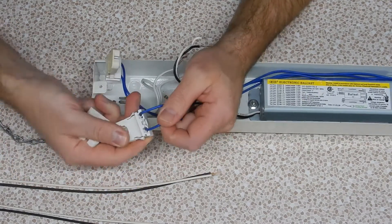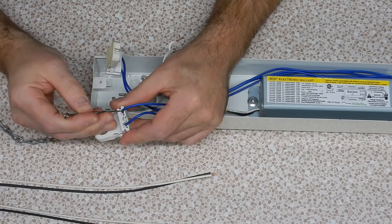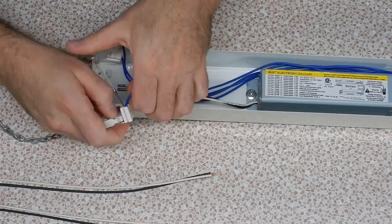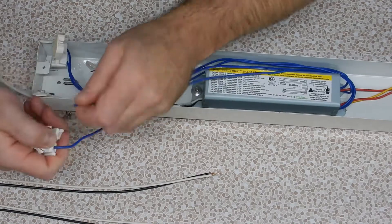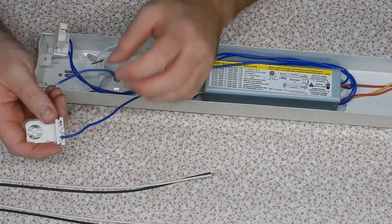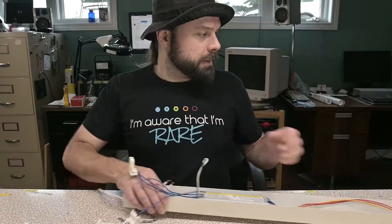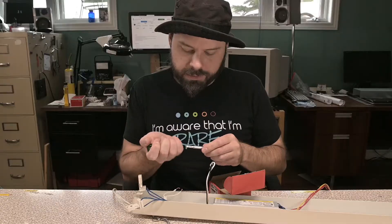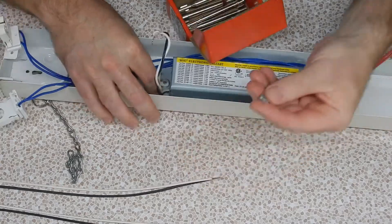If you have to reuse these, it's not a big deal because they just have these little slip connectors — they have two holes and you just kind of slip something over top of the wire, assuming it's not super tight. Sometimes it requires a little finagling, a little bit of twisting and pulling. You might damage the little push connector a little bit when you do that, but fortunately there's two holes and the other one should still be fresh. You just need a little wrench thing to go in there — 5/16ths. I'll save this ballast for some other form of conversion that I might do.